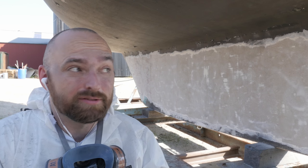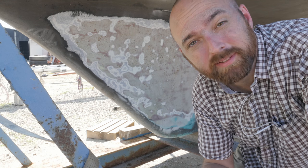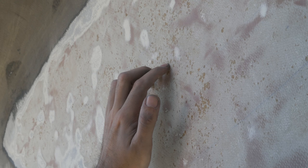So that took me an hour and 40 minutes, roughly. In the previous video, I told you guys that the forward one-third of the hull had a few layers of extra fiberglass applied when they peeled the gelcoat back about eight or nine years ago. Whenever I'm sanding those areas, something kind of interesting happens. As soon as I've sanded off the barrier coat, these wet dots appear, and in behind that little wet dot is a void. It seems quite obvious that the yard that laid out that fiberglass didn't wet it out thoroughly — but that's not really the interesting part. The interesting part is that the liquid in there doesn't have the smell like the other blisters of vinegar, and it doesn't taste like hydrochloric acid either. It's just like stale water. I imagine what's happening is that water gets trapped in those tiny voids, but that water doesn't reach the hull because there's a layer of epoxy there. And epoxy degrades far slower in contact with water than polyester does. So I think that's why that liquid is basically just stale water and not like the vinegary stuff from the other blisters.